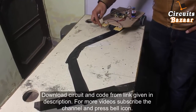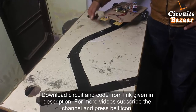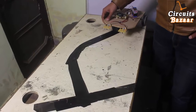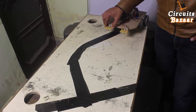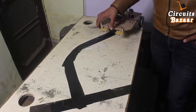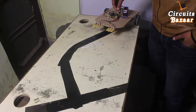So this is the IR sensor — either one or zero will come out of this sensor. If there is a white surface, the radiations from the IR transmitter will be reflected back, received by the IR receiver, and that signal will be fed to the LM358 IC — then accordingly a one will be generated. If there is a black surface, a zero will come out of the circuit. If you want complete details about how an IR sensor works, you can search 'Circuits Bazaar IR sensors basics' on YouTube. Now I am going to provide the power supply — red is plus, black is minus.